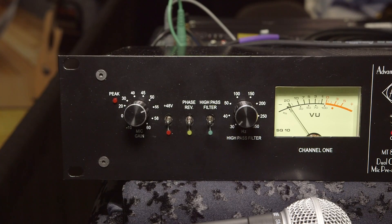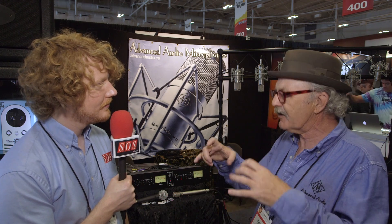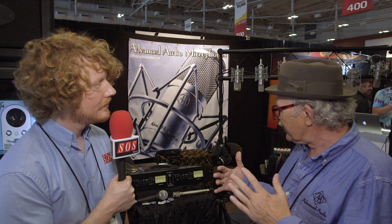It's really well laid out inside. Everything is through-hole soldered, not surface soldered. Some ICs in there and they're on sockets. The beauty of the circuit is that it uses an IC input stage, but it uses two ICs to give you the 60 dB of gain — so each IC is only doing half the work and the gain is brought up together. That's what made the Trident.